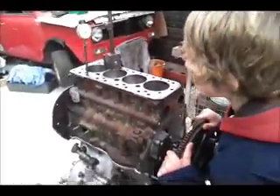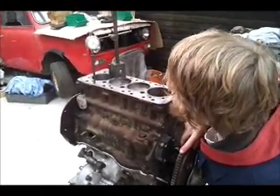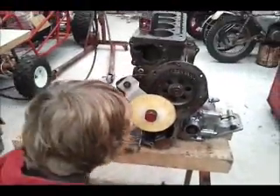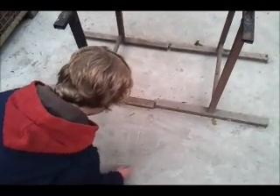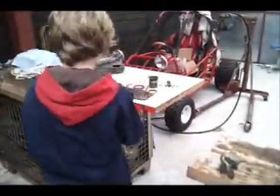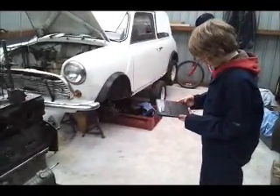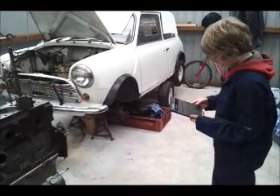Then I go back and bounce it back the way we came from. Back on 5 thou from when it bounces off. I'm going to record what that reading is: one two five. So we do 125 minus 91 which equals 34.